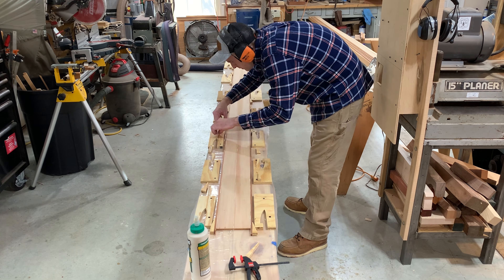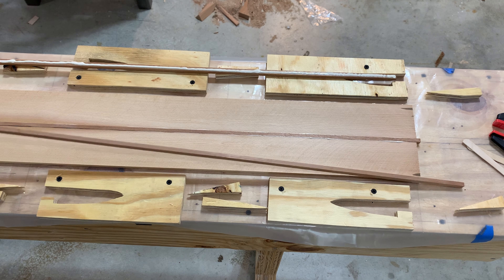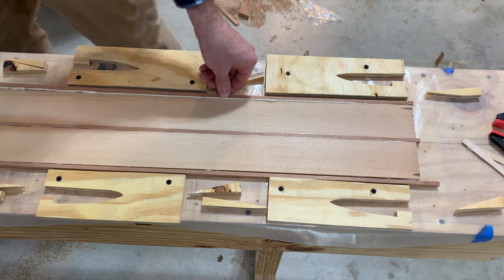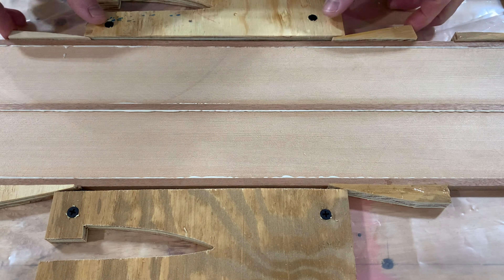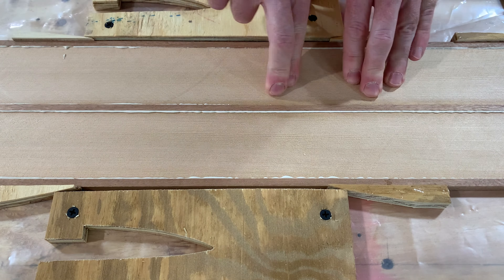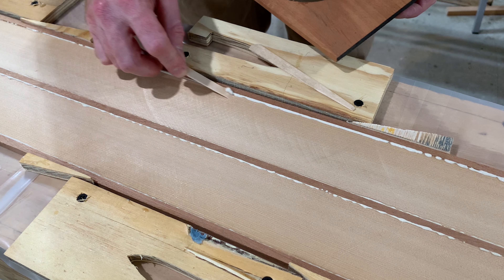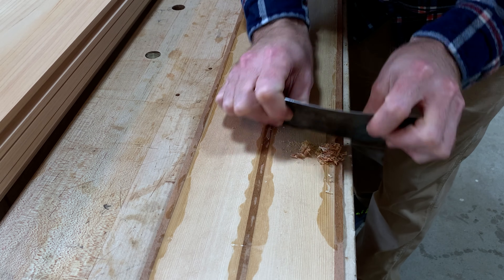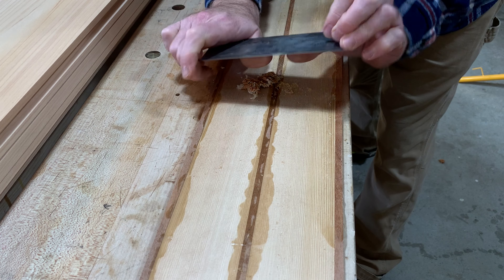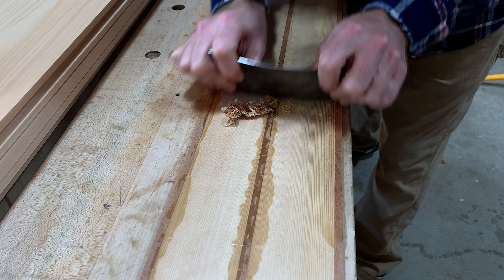I'm using the strongback that I put the molds on in the last video to do this, but I actually brought it over to my bench. I made sure that the center piece was straight as an arrow, and then when I clamped my other boards to the sides of it, I know I've got a fighting chance of having a straight layup. These are just little popsicle sticks with a bevel on like a chisel — makes it easy to clean up the glue when it's wet so you don't have to clean it up when it's hard. The underside cleanup, where I couldn't get to against the bench, a scraper worked pretty much perfectly.